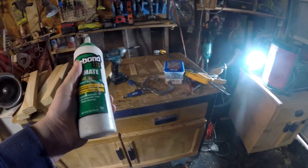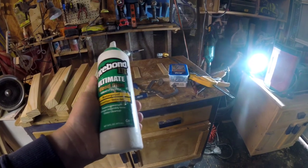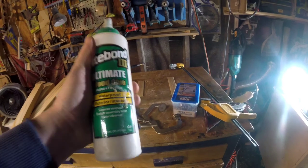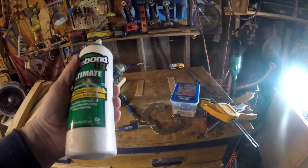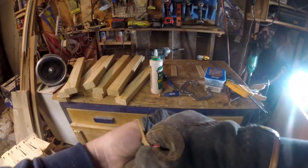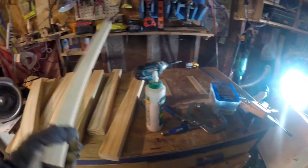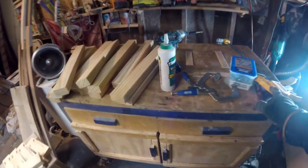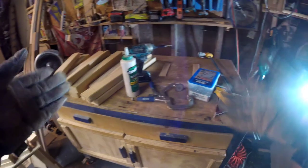And a little glue. The glue I'm questionable about, because if I'm using 2-inch pocket screws, they pretty much hold, but I will put a little glue, especially if I don't think I have a tight joint. But I don't like putting the glue because it really makes more of a mess. And also, if you put these things together and you start noticing a wobble for whatever reason, whether it be one of these legs is cut a 32nd of an inch shorter than the other, they shouldn't be, but wood doesn't always square up right, even though the square might say it's right.